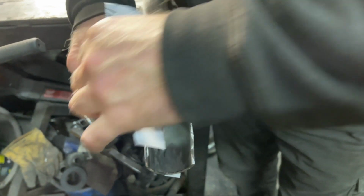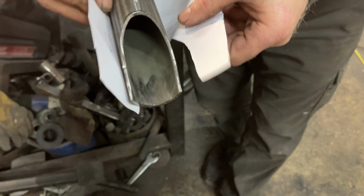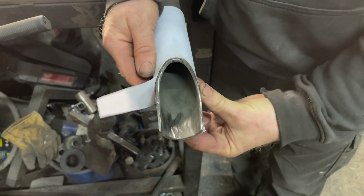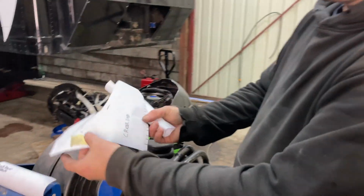All right, so then we just overlap them back over each other. So I'm going to have to cut another little piece off. No, we're not going to use that bit at all. So as long as I don't go past there, we know we're all right. Line everything back up, and there you go. So now we can take this off. We can put a centre line on the new tube, because that is the fish mouth we want. So then we can transfer it onto the new tubes. So then you end up with this, and then we write on which end it is.